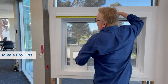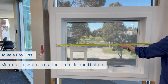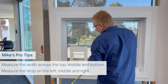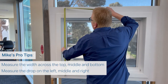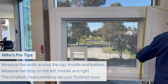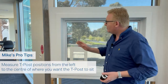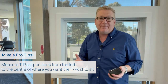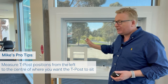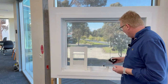For outside measurements, we go from the outside edge of the architrave to the outside edge — in this case 1340 millimeters. Height measurement always goes from top to bottom: sitting under the lip of the architrave, I've got 1035 millimeters. T posts for an outside mount L frame always start the measurement from the outside edge of the architrave, working from there to each T post center.